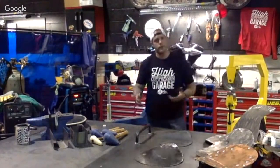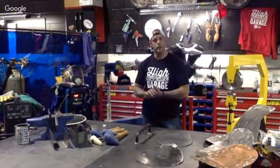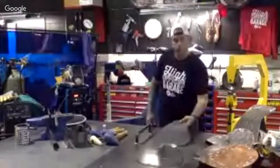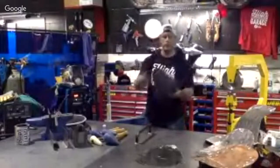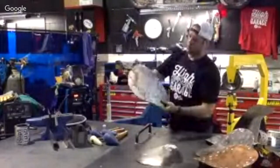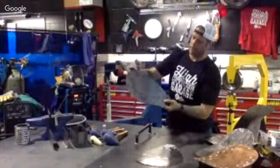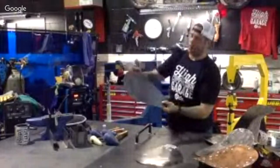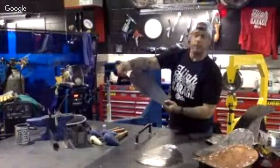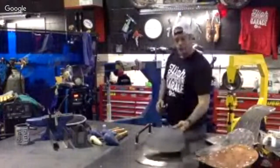A Beverly shear is something that you can get for a benchtop in your garage and simply cut right through the metal like butter with that. It helps cutting with larger bends like this. This one we actually cut out with a Beverly shear, and you can hopefully see there's a lot of burrs up here on the sides that we're going to take down, but a Beverly shear does leave a little bit of cleaning up to do at the end. So that's another nice piece.